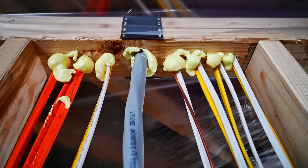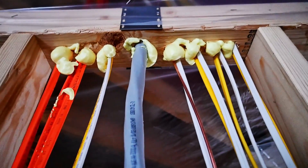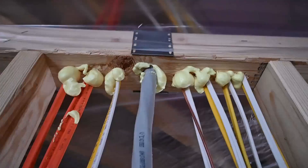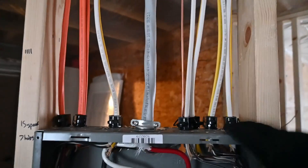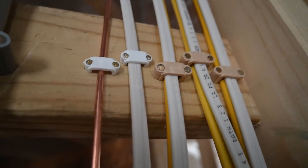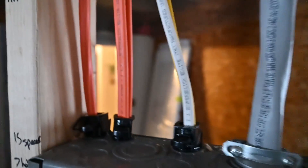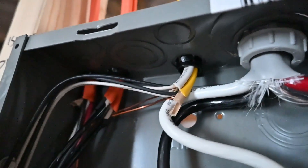You can see how they brought their wires down through the top plate — two cables going up through the top plate each — and at the center point where the main feed is coming through, they did use nail plates to protect that cable. They sealed those holes with spray foam to prevent air infiltration and to meet fire code for sealing off this stud cavity. Within 12 inches of the top of the panel, they have a 2x4 nailed horizontally to anchor all of the cables, stacking a maximum of about two cables per cable staple. The cables then feed into the top of the panel using plastic connectors, with insulation coming into the panel a good inch or so.